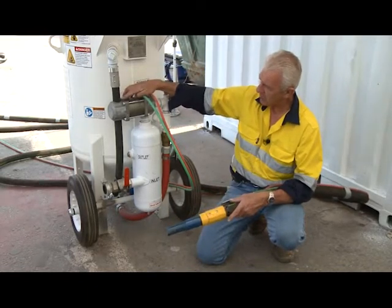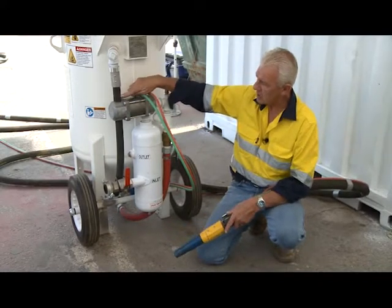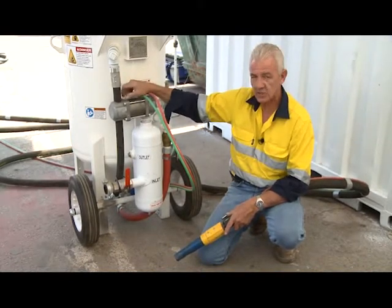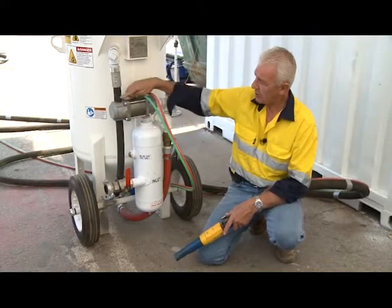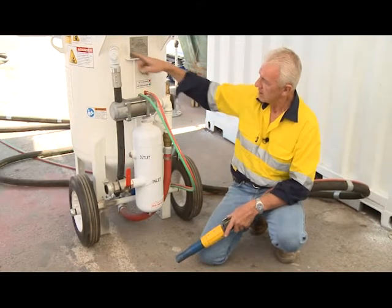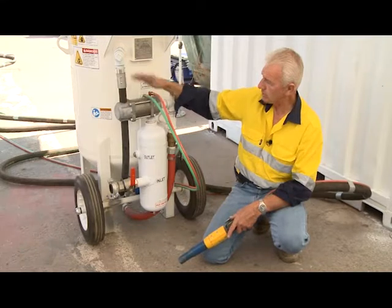This hose here is what we call a sacrificial hose. After a period of time of the wedge coming across and pinching onto it, it has to be checked. It's mandatory that the hose is checked for integrity each week. After 40 hours of blasting, check the integral wall of the hose to ensure the wedge has not undermined its integrity and it's starting to leak air, because if you leak air there, you're not pressurising the pot appropriately. This is the combo valve that enables all of that to happen.